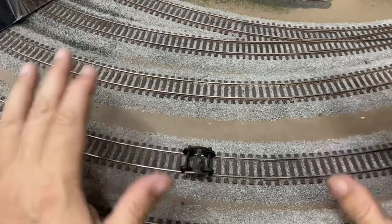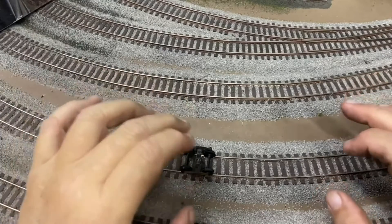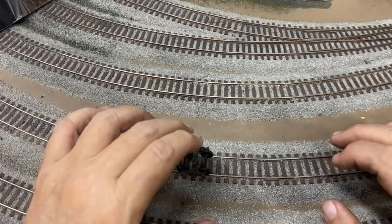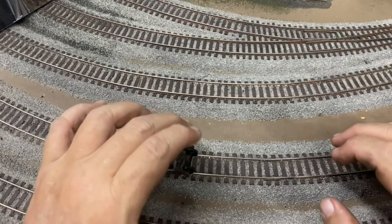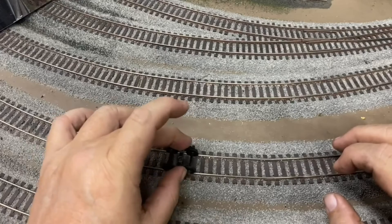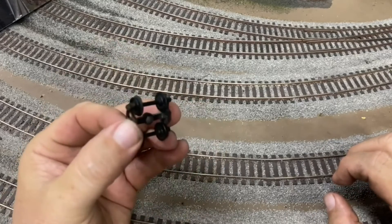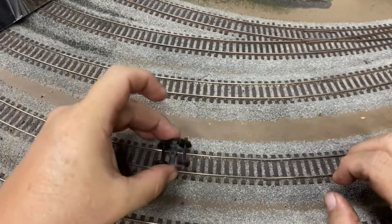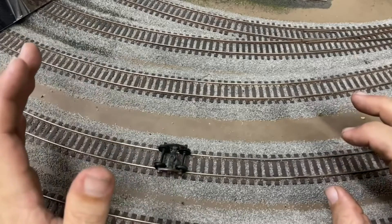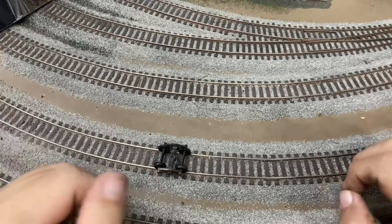If those cracks aren't detected, you have to call in a specializing service like Sperry Rail to detect those microscopic cracks. Another way it can cause damage is if those microscopic cracks are already there and the flat spot hits them at the same time — that can cause an instant crack in the rail. It could also possibly damage greasers, switch tracks, and defect detectors.